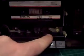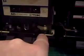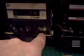The main bearings are worn out on the capstan shaft. Fortunately for Adam, I had another one in the shed in a wreck. The bearing on that was alright, so I was able to modify that, and thankfully most of the mechanism being made out of very hard sort of resin-like plastic, I was able to just withdraw the old one and press fit the new one back in, and then away we went again. The spring that holds the pinch roller down on the tape was also tired. It was a completely different shape to the one here. Adding fuel to my argument about this deck probably saw the most use because it's the recording one.